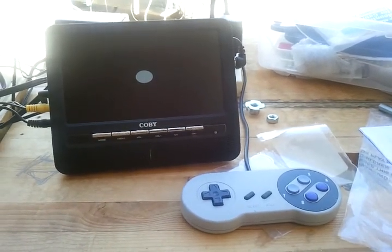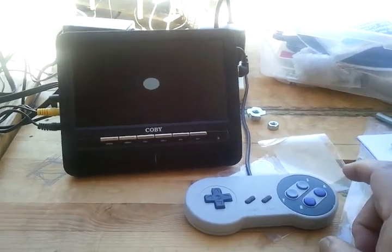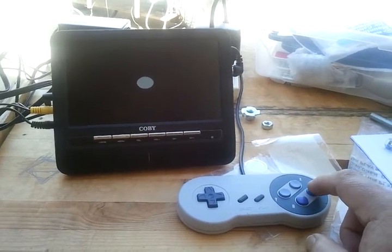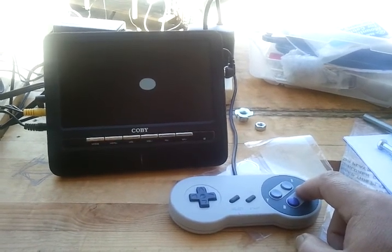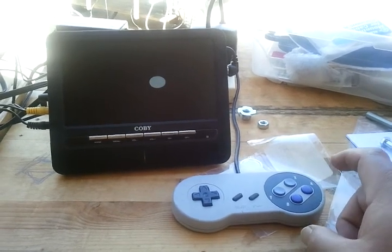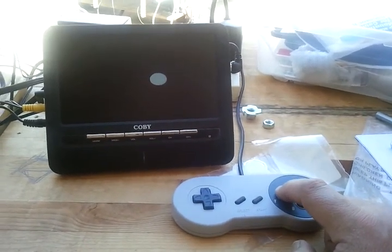Here we have the telescope tracking the sun. This is the control panel for the manual control. The digital logic in the controller is all that's needed to control the rates. You can hear that buzzing — that's one of the axes. You can see the sun slowly moving to the right. The clicking you hear is the drift rate adjusting for the sun's motion through the sky.